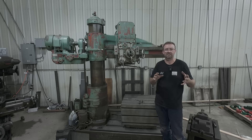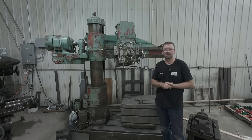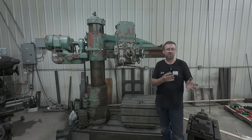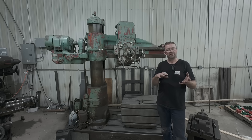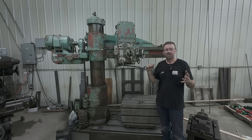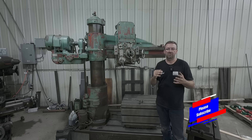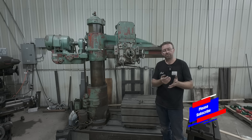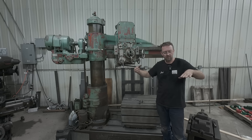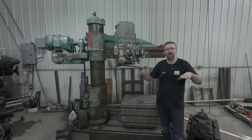It's a really neat process. If you get a chance, find some gun drilling videos online and watch how it's done. Gun drilling goes back to drilling rifle barrels — that's how it all got started. There's a special grind on the drill as well. High pressure coolant oil, generally a couple thousand PSI, is forced through the drill, pushing the chips back. Multiple supports on the rotating drill, a fixed part, and it's hydraulically fed at a steady rate — really cool process.